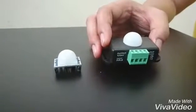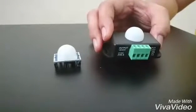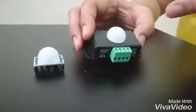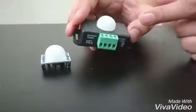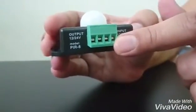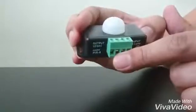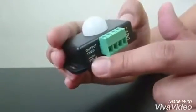The idea is that the electronic sensor measures infrared light radiating from objects in the field. When we talk about objects, this can be humans or animals that emit body heat. Once the PIR detects the infrared heat it will trigger an output. For this 12-volt PIR system, the input is powered by a 12-volt power source and the output triggers once body heat is detected — the output also being a 12 or 24-volt device.